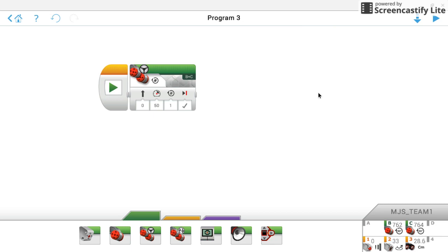In this video, we're going to make our robot react to the touch sensor, or the little button sensor mounted on the front of your EV3. Now, if you look at the bottom status window here, it's clear that I have the touch sensor installed on port 1, because that's the touch sensor icon, and it'll actually show me the state. So right now it says 0, and if I were to press the button, it changes to 1, which signifies that the button is being pressed.